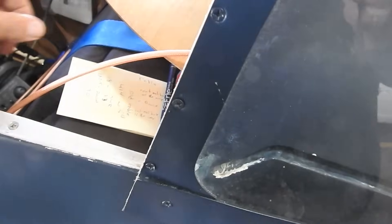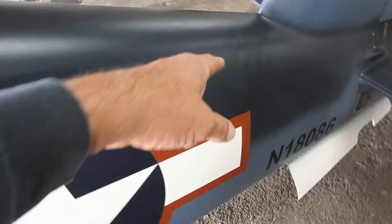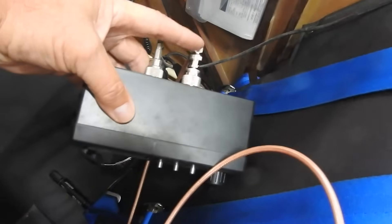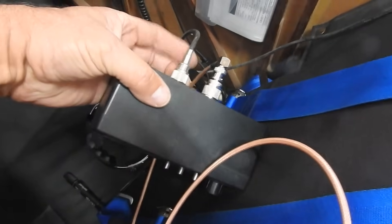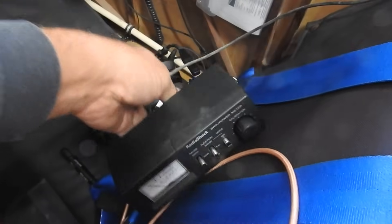I'll take these home and ponder it, but I'm pretty sure I've got to shorten the antenna. If I've got to take it apart, I'm probably going to buy the correct BNC connector to put back in the tail, and then I won't need that adapter. I did need the adapters to get from a BNC connector to PL259, which is what the CB radios use. I had to get two adapters for that, and I was able to test it both ways — and they're pretty bad, pretty sad.